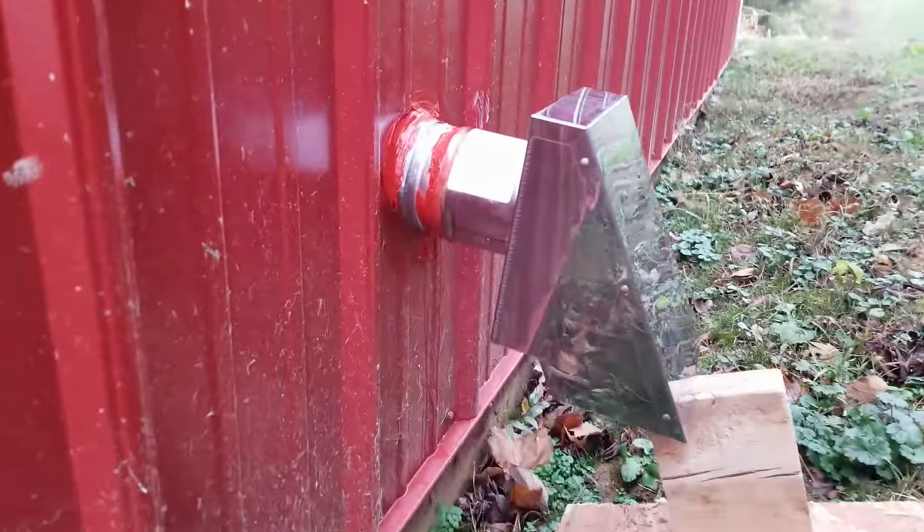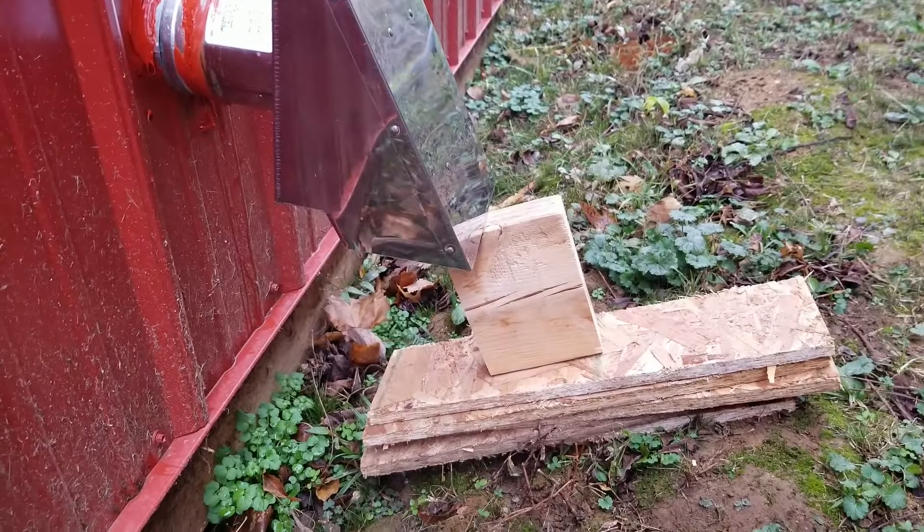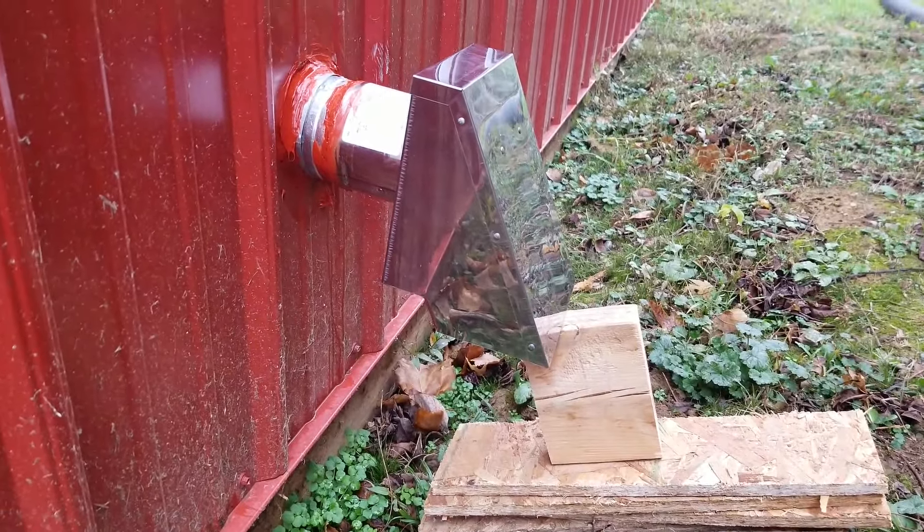On all of these numbers and everything, guys, make sure you're consulting the instructions with the stove that you bought — not all of them are going to be the same. This is not a how-to install a pellet stove video; this is just a video about me installing a pellet stove. So disclaimer, that's all this is. I got my end cap slipped on out here, got it sealed with the high-temp silicone just like inside. I propped it up on a couple of boards to make sure it dried, put a level on it, made sure it was nice and level so everything stays where I want it until the silicone dries. Got to give that silicone a little bit to harden up, and then I'm going to fire this bad boy up and we will bask in warmth inside the shop.